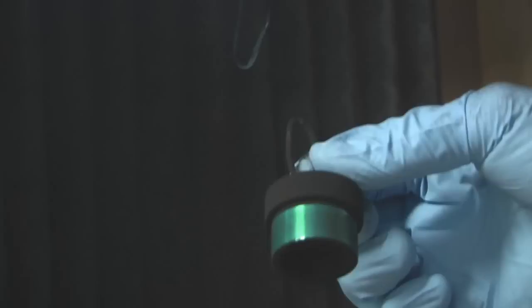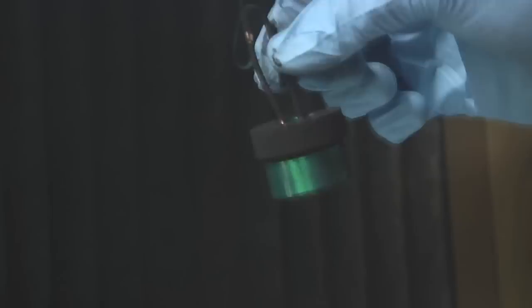I do like to take them and inspect them. You have to be very gentle with the parts, because if you brush any of that powder off, you have to start over again. Thankfully, it's very easy. You can just blow these parts off with an air compressor or vacuum them off, clean them up, and start all over again. It looks like there's a little bit of clumping of powder in a couple of spots, but this is not really a super critical part for me. I think I'm happy enough with that. I'm going to get these set up and get them into the oven.